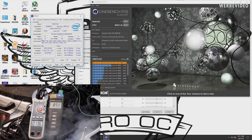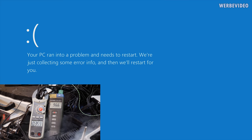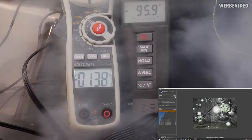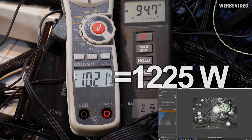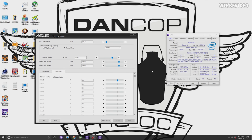Unfortunately 5.6 GHz was not stable in R15 even after we increased the core voltage to 1.45 volts. At 5.5 GHz with 1.45 volts the power draw was absolutely insane — the current clamp showed over 100 amps to the VRM, which is over 1,200 watts across the VRM. We estimate the actual CPU power draw at something like 1,100 to 1,150 watts depending on the switching losses.